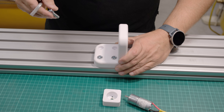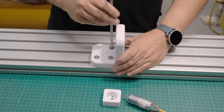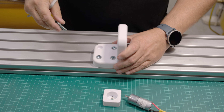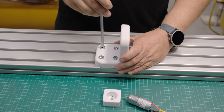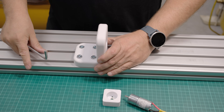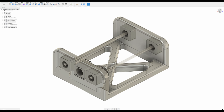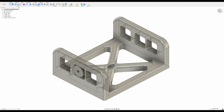Smaller modular parts, however, can be reprinted in just an hour. Once I had a working mount, I realized its potential — this was not just a bracket, it was a system. That sparked the next idea: why not build a tumbler, a rotating machine for polishing aluminium parts designed entirely around modular blocks. The design included a lightweight frame, a bearing module and two custom gears. I chose gears instead of belts simply because I had no pulleys or belts available. Necessity often dictates the solution.